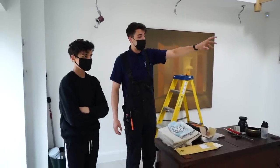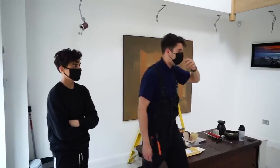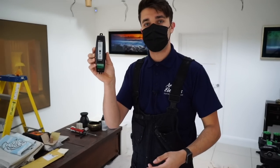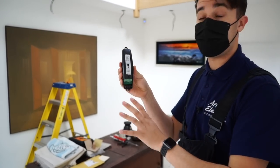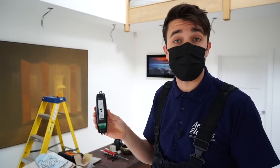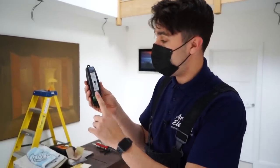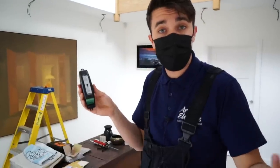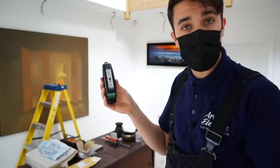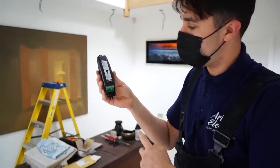They want to replace them with the JCC lights and make them compatible with Lutron. What we have are these RA2 inline dimmers - an incredibly simple bit of kit, so easy to install and so clever. This is not a Lutron-sponsored video, it's just technology I genuinely believe is really good. All you're doing is feeding the dimmer and then you've got your load - your live terminal from the consumer unit or looped rows, and your load terminal out which is what's dimmed.